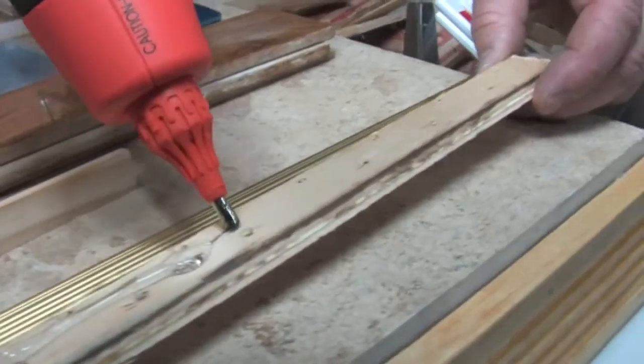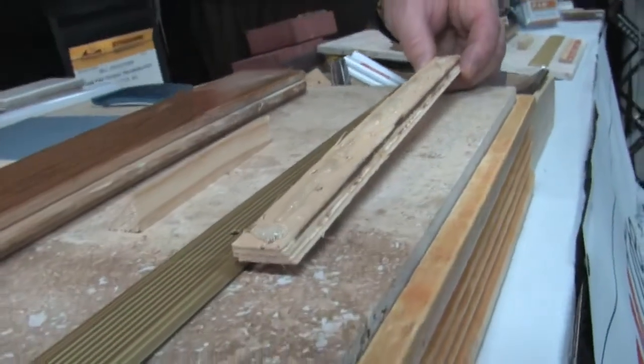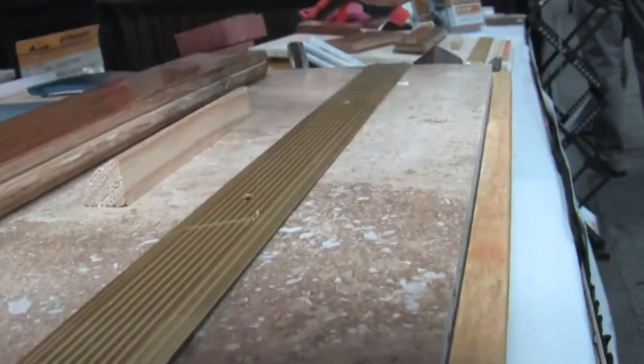What's really special about this product is that we are a suitable replacement for many of the tube adhesives and construction adhesives that are out there. With this product, you have the strength characteristics of tube adhesives, but it sets up much more quickly. You may be used to a product that takes anywhere between 12 and 24 hours to set up. This not only grabs the substrate immediately as soon as you stick it together, but it's fully cured in five minutes. So if you're doing tack strips or putting down starter rows for hardwood, you don't have to glue the pieces together and come back later that day or even the next day. You can put the pieces together and in five minutes complete the job.